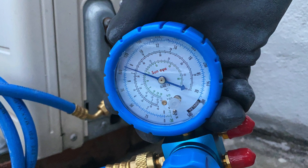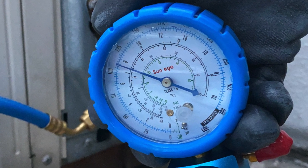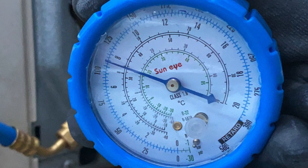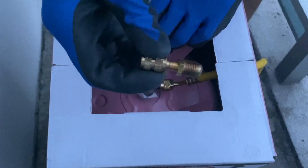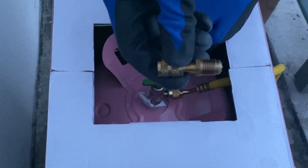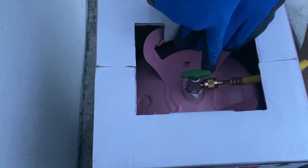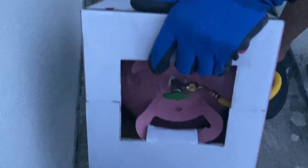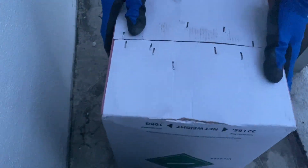Any reading in the outermost scale less than 118 to 200 psi is considered low in R410A refrigerant pressure. You might need a converter if your hose is not meant for R410A refrigerant. I choose a higher concentration brand of gas for better cooling efficiency. I will then turn this green valve slightly over a quarter turn.